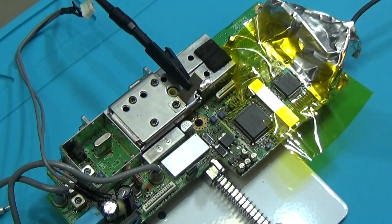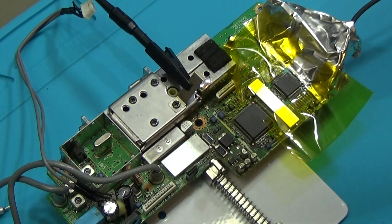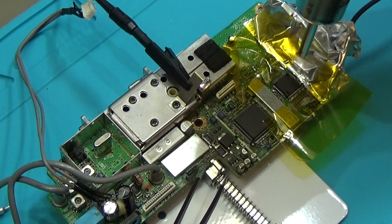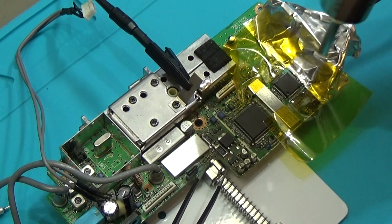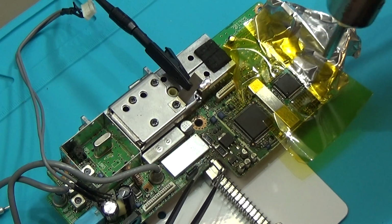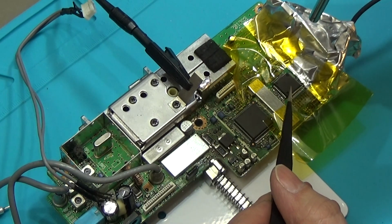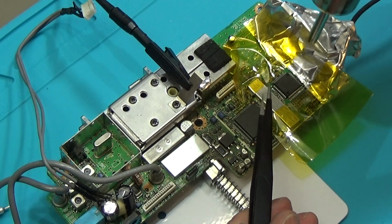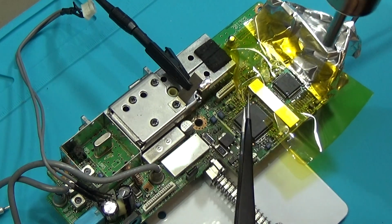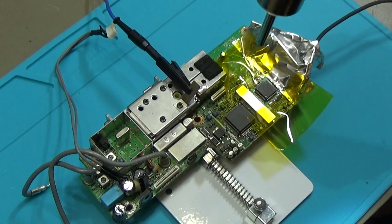and let's wait until we have the right temperature, and we start at a respective distance, not to shock the board. So very carefully heat up the board itself before we go down and try to lift the IC off our PCB. Don't know if you can all see. I hope. It's a little bit difficult.